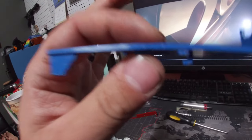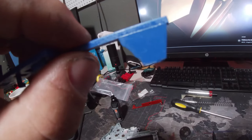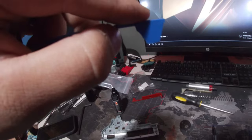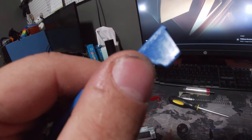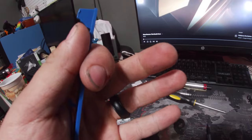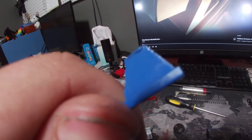So I cut the tappet plate. What I usually do is I cut it, then take a spoon, burn it, put the plate over the super hot spoon, and smooth it out. All the frayed parts and cracks get melted back together — they bind and harden just like the normal plastic. I always feel like it re-strengthens it.